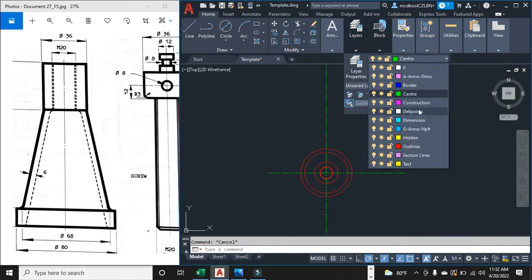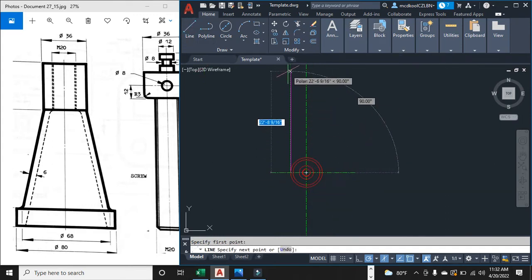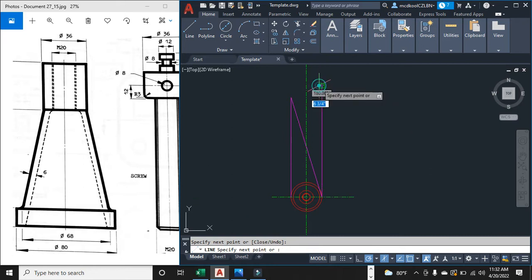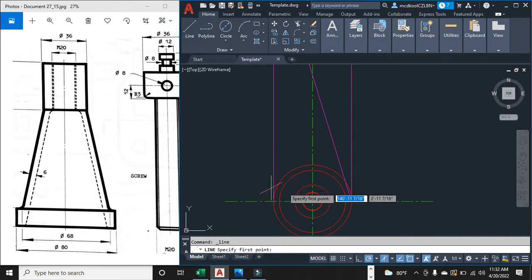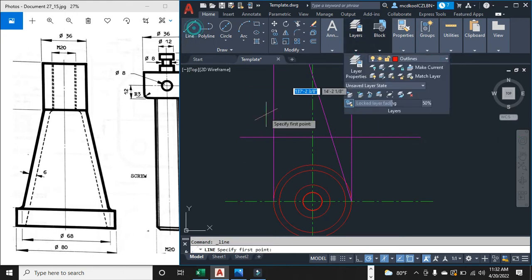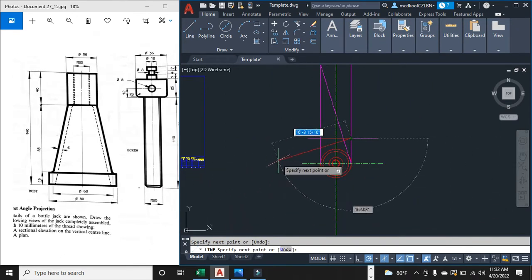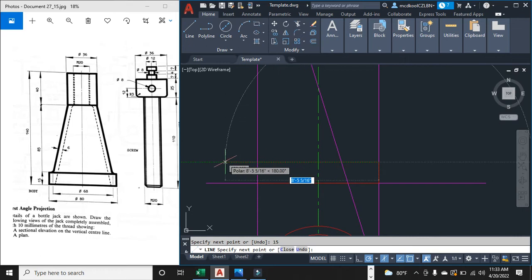So now I'll project upwards. The thing is that you want to start your drawings like this so that you have more than one view at the same time. Once you do the view in the plan view, you continue to do the view in the front. So I just projected up the outer lines. So I'll do the base of this front view. You following this so far? So the height of this little piece here coming out is 15. And I'll just draw that across long and finish this piece.